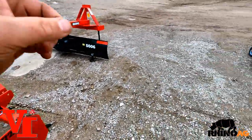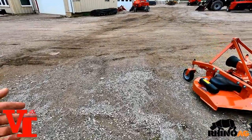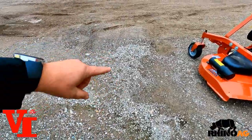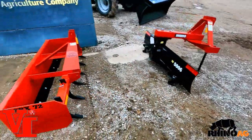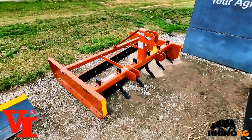Another great feature is how material comes up and lifts over the angled blade — it fluffs the rock and puts the rock up on top with the fines down at the bottom. This is great for rejuvenating your driveway — putting the rock back on top versus packed down in the fines, mud, and dirt. That is the third key feature of the grading scraper.